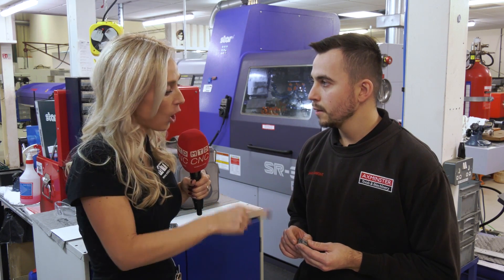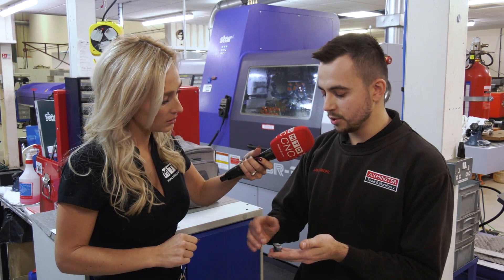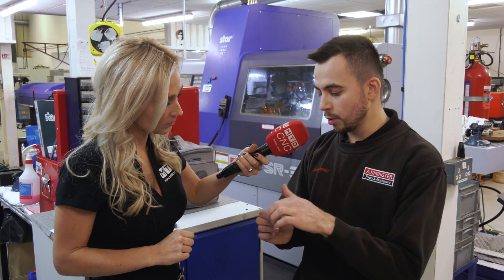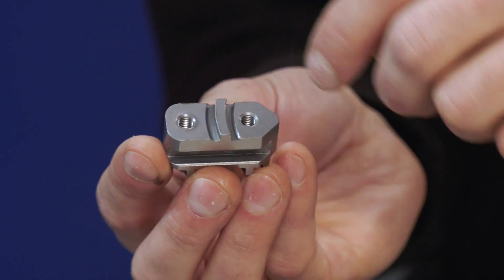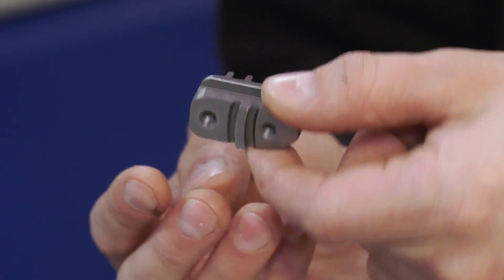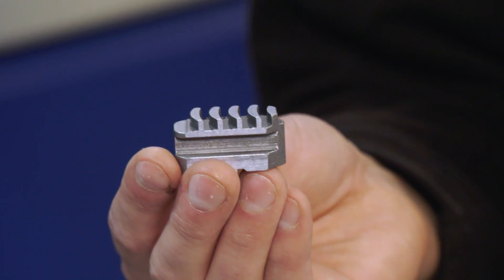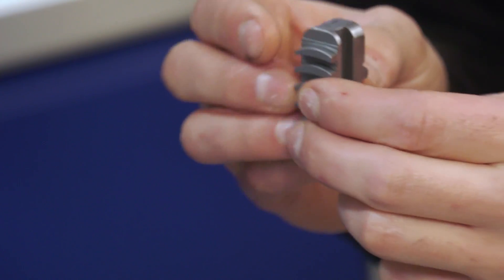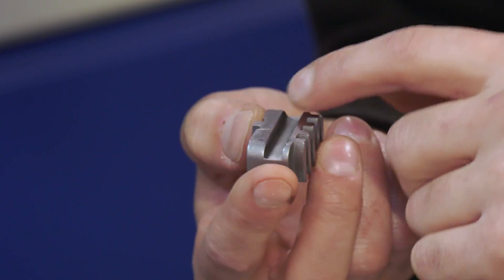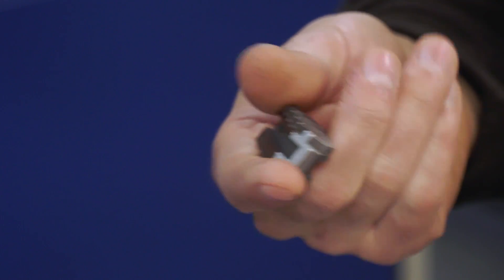Can you talk me through the processes for this on the Star machine? Basically we have two ops to mill it — one op we do the top part and then we flip it and do the bottom part. On the top part we have threaded holes which are roll tapped to give a strong thread, then there's plunge milling and some side grooving. On the other side we plunge mill the teeth here. At the minute that's two ops and we get inaccuracies with the way we're holding it, so unless the operator puts it in exactly as it's supposed to, there's always a little bit of movement which causes a lot of scrappage.